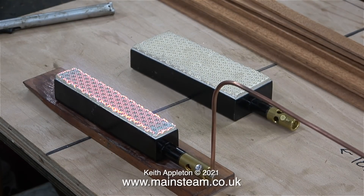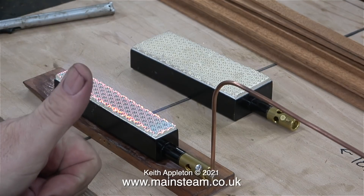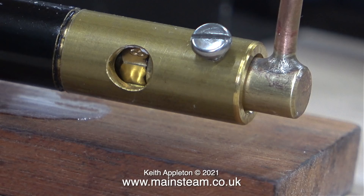I still think it's a little bit on the bright side. I once read a BICS burner instruction leaflet and it said you should aim for lots of little blue triangles above the burner. This is much better — it's not overheating and the burner should run all day long at this temperature. This clip clearly shows how far the number 8 jet is pushed into the Venturi.